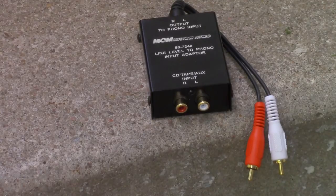I actually drew the thing out, and I was going to show you the schematic, and it's so basic and so obvious that I'm not going to bother to tell you or show you what's inside it. I can tell you that there are 2 capacitors and 3 resistors for each channel, and that it looks a lot like the opposite of what the filtering is in an old Dynaco PAS preamp. So if you know what I'm talking about, then you can reverse engineer this from there.